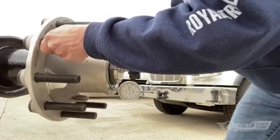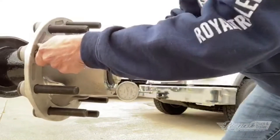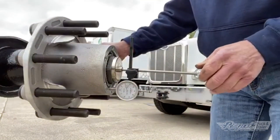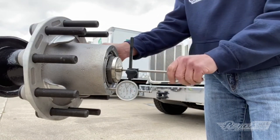We're looking pretty good here. We have about three thousandths — right back to zero. So we have our acceptable end play of three thousandths. We're allowed between one and five thousandths.